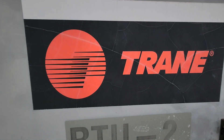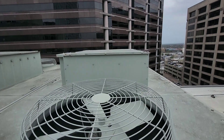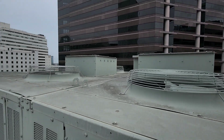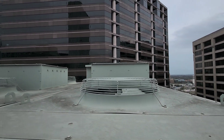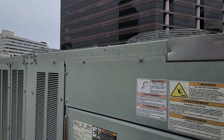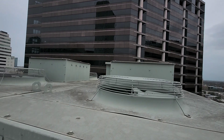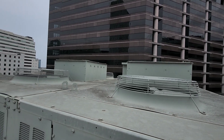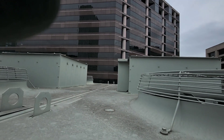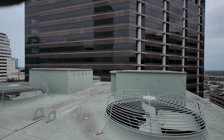This is one of the older units. That box right there in the middle — that's a damper, same with that one. They use that for head pressure control. On cooler days it'll stay closed to keep more heat in the coil. It's literally used for low ambient cooling. The newer ones are either on drives or contactors kick on and off — there are a bunch of different ways. This is a little more old school. Inside that little box is an actuator, and that is literally how they control the head pressure.